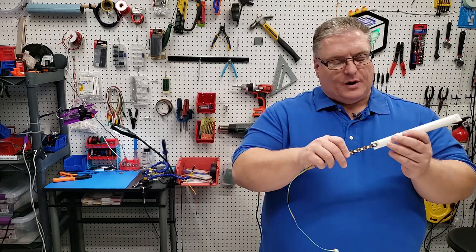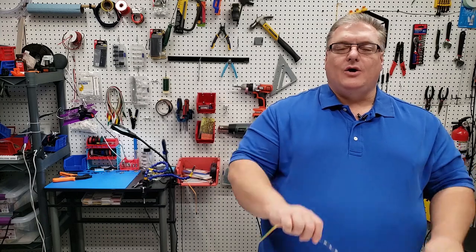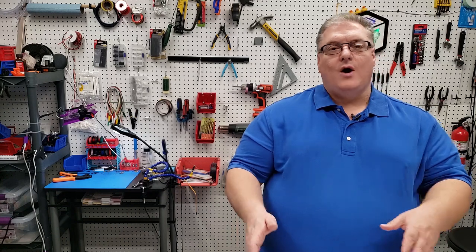After that, we're going to place the LEDs inside the bar, then we'll attach this to our printer and hook this up to the main board, the SKR version 1.4. Then we'll configure Marlin so that we can control these lights.